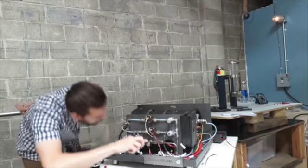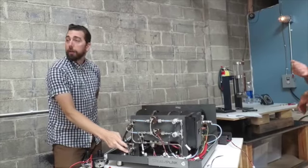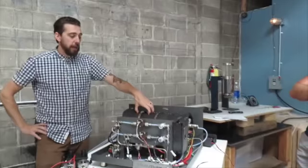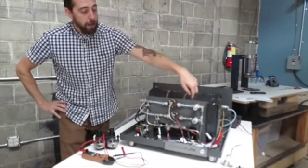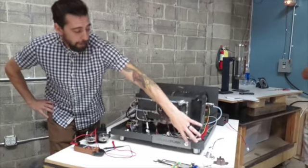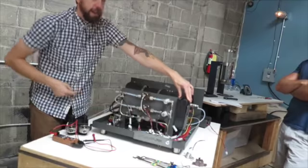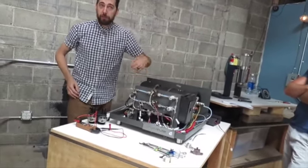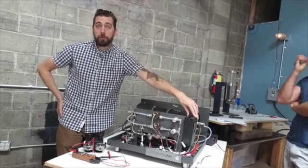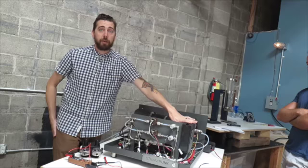And if you look underneath, you'll see it's 2 purple lines, and those are the V negative that turn on and off this boiler fill right here. And then the other components, as far as the negative and positive 24 volt, go through the power switch to the computer. So when you turn on this, it allows 24 volts to the contactor, which allows 220 through, and also turns on the computer. So until the button is pressed, this computer doesn't get power either.